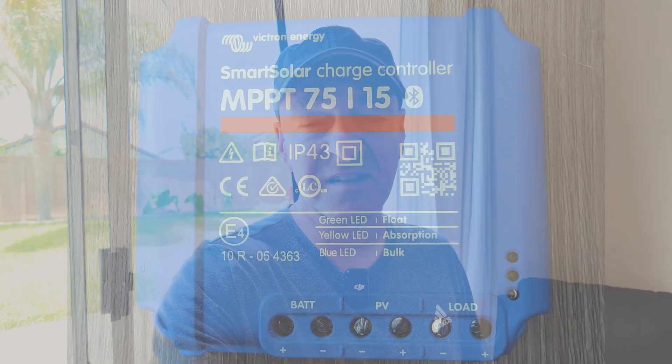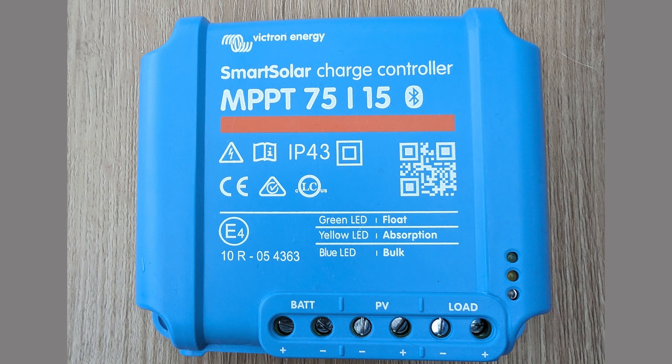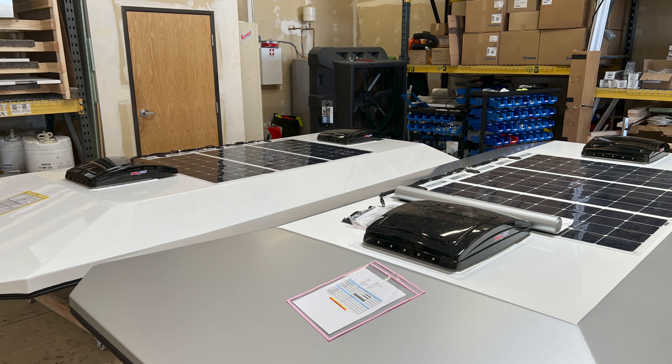The first thing I noticed was that the solar charge controller was completely undersized. With 330 watts of solar, I never got higher than 209 watts going into the batteries. It was fall, but that wasn't the reason — the solar controller had a hard limit of 15 amps, which correlated exactly with 209 watts. I could not use the remaining 121 watts sitting on the roof. I probably should have been getting 280–290 watts in. So I knew the solar charge controller needed to go.